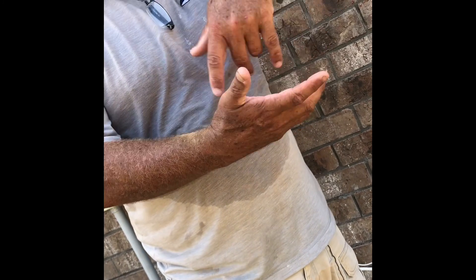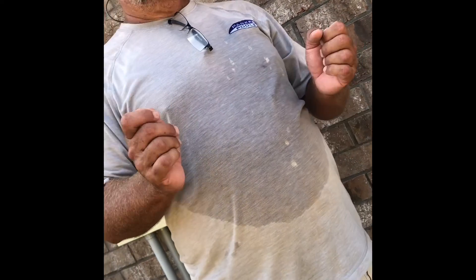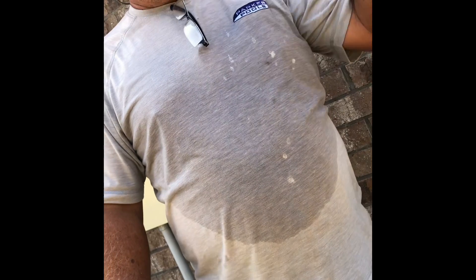Stop the suction. That way, when you pull the basket out to go clean it — especially because eventually we're going to have leaves — when it gets clogged up with leaves, turn your pool off so that nothing's being sucked in there. Wash out your skimmer basket, come back and get all those other leaves that are still floating around in there. Clean them up, put them in your basket, go dump it. Make sure the whole skimmer's clean. Then put your basket back in and start your pool. Because if you pull that basket out and the pool's still running, leaves will go down. Whatever's still in there — a lot of times they get stuck in the flap, and they'll go in your pipes.